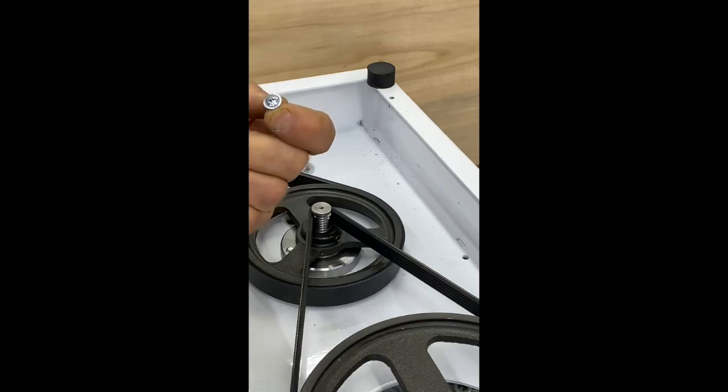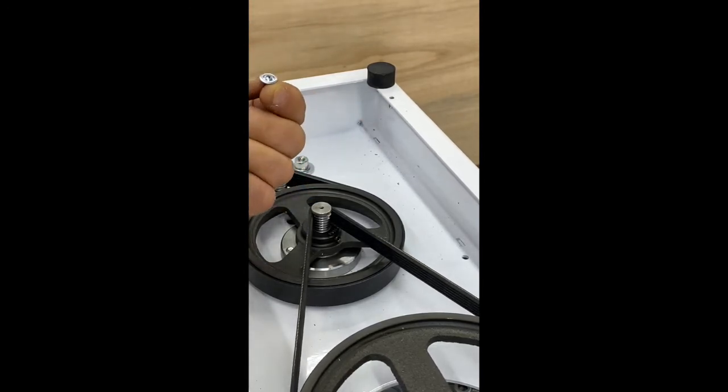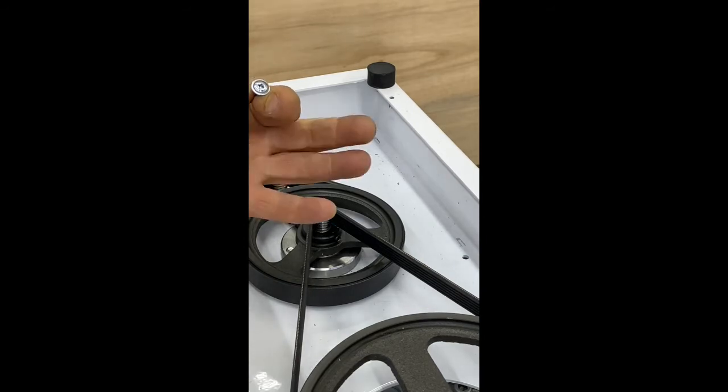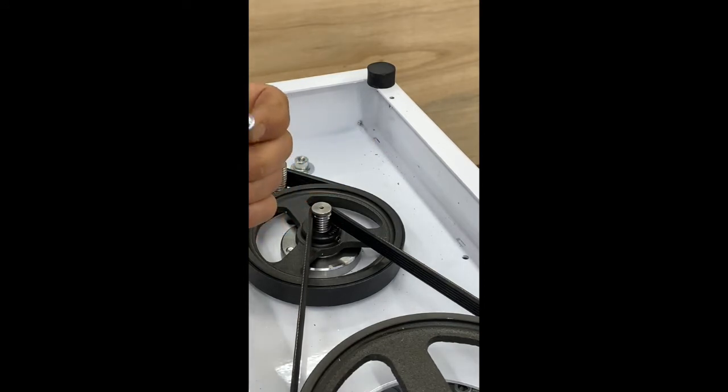It takes a Phillips screwdriver. Using a hand screwdriver instead of a power driver, because a power driver, if it slips off, can easily scratch your paint badly, and of course can snap the head off when you are putting the screws back in.